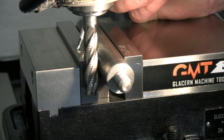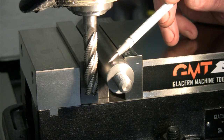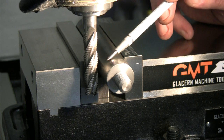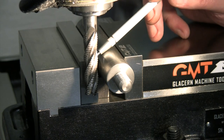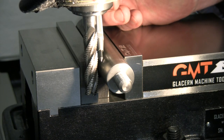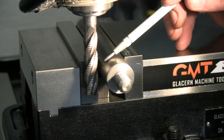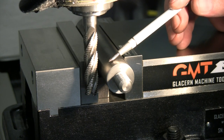All right, so here's our setup. We've got it clamped in the mill, and I wanna feed about 400 thou to make sure I get the width of my wrench, a flat spot on there. So I made sure I have enough clearance here on my vise. I'm gonna touch off on the edge, on the outside of that radius, and I'm gonna feed over 1/8 of an inch, and then I'm gonna feed down towards this end, 400 thou for the width of that wrench,